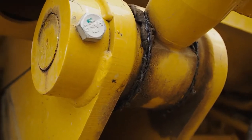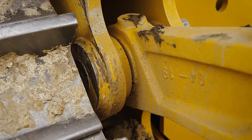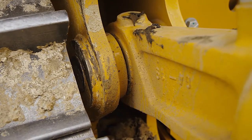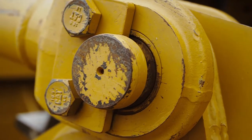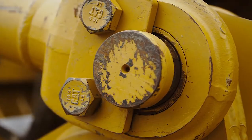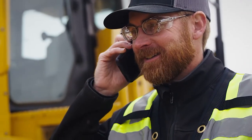Check the pins and bearings for evidence of loss of lubrication like leaks, damaged or missing seals, or rust around the pin. If you've noticed unusual play in the blade, like the blade is down and the push arms are still moving, take a closer look at the pin and knuckle joint. Should you find any problems, you should make arrangements to repair them as quickly as possible.